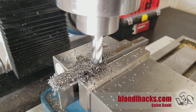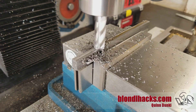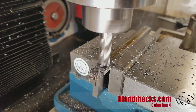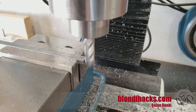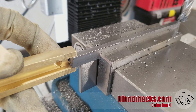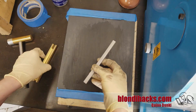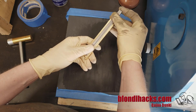This 1018 steel is leaving quite a burr, but getting the job done with these roughing passes. I'll do finishing passes as well with higher RPM and slower feed for a nicer finish. Squaring up the ends as well. Test fit on our brass channel and it's perfect. Now I'm fine-tuning the fit on the lapping plate using some 320-grit wet-dry emery paper — going for a very precise slip fit. That's kind of a snap-in fit, so just a little more.